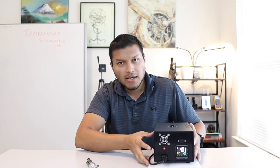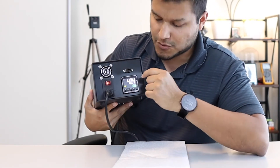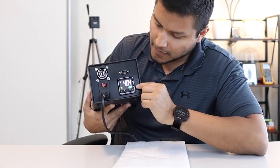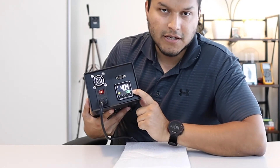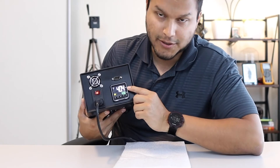If we look at the unit itself, down here you'll notice there are two screens. The first one is the PV — the present value — which shows whatever temperature the unit is currently at. There's also a Fahrenheit option available. The bottom value, the little green number, is the SV or set value — that's the target temperature.